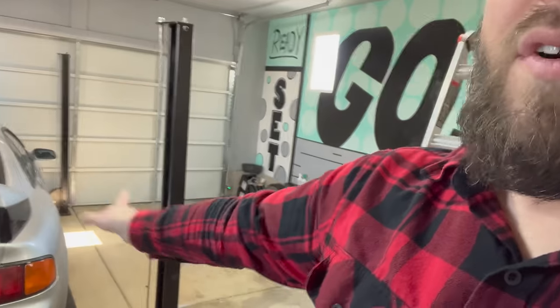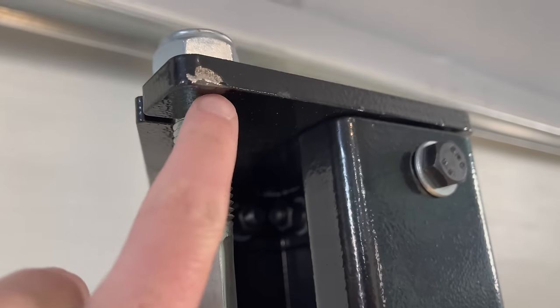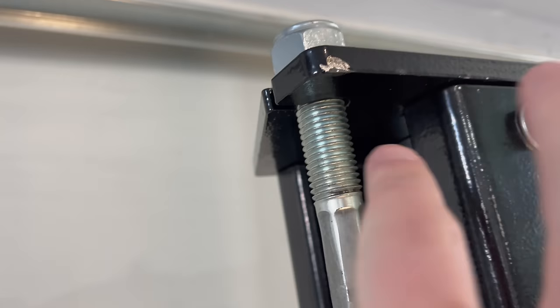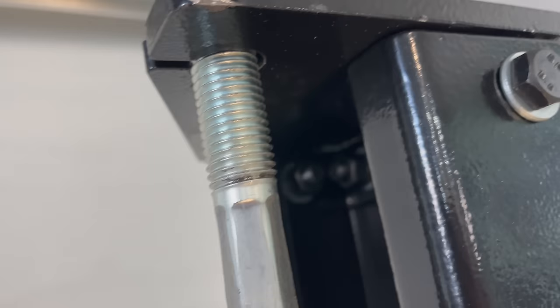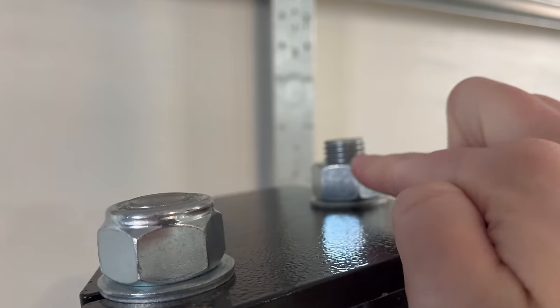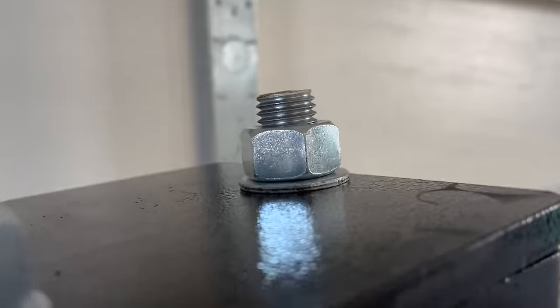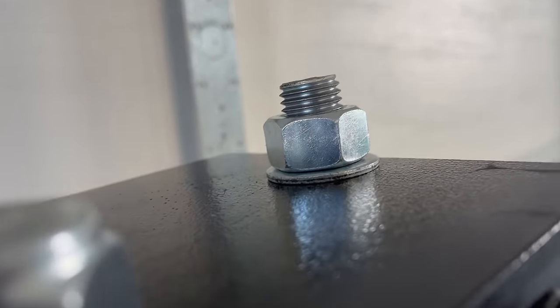It's about eight degrees outside right now. I just wanted to take you through a few pointers on operation. One annoying thing is they come with a lot of scratches and chips all over them from shipping. I'm going to go over it with POR-15 — it's a rust inhibitor that leaves a little bit of a seal anyway. I'll brush that on soon. Another thing: when installing the caps, make sure they're all level because these are your locks — you want all the locks to engage at the same time. Because I had a couple of people helping, these didn't all end up at the same place, and later it was a lot more difficult to pull out and adjust than it would have been at the start.